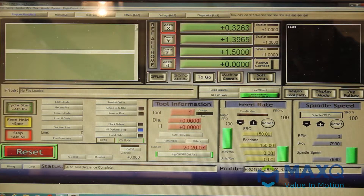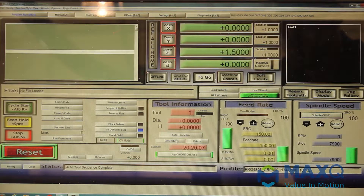We'll go ahead and select those once our post is at the zero-zero point that we want on the table. Wherever we want our origin to be, that's where we zero X and Y. Now for zeroing the Z axis, we do not press Zero Z.